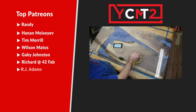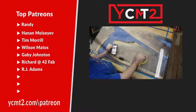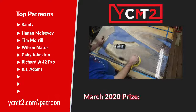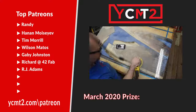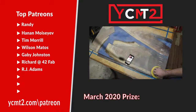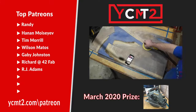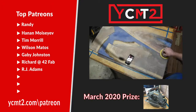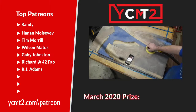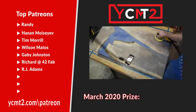One thing I really liked is it's quiet and comfortable enough that I was able to go full lazy mode, which I enjoy doing, and catch up on some YouTube videos while I sanded. And almost unbelievably, I was able to sand all of the seepage of epoxy off the top with a single 40 grit net. The only thing that would have made this go better would be if I'd used some penetrating epoxy on the bark before doing the pour, because the bark is a lot softer than all the surrounding material.